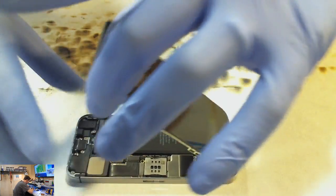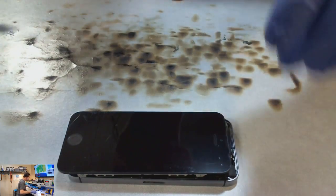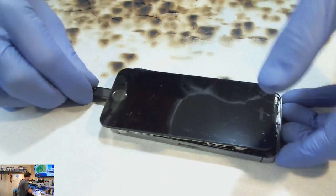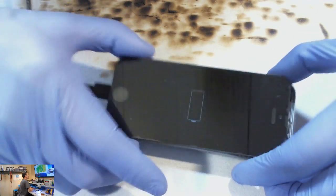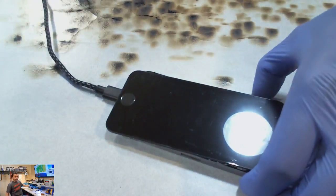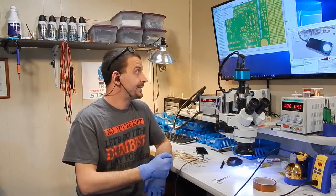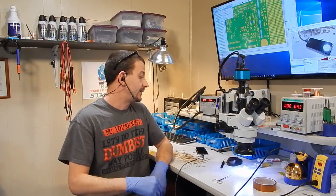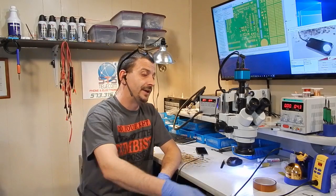I left out a critical check here - I should have checked to make sure my backlight circuit was not shorted to ground, but I forgot. So we're just going to go with it. Plug in our charger. We have battery icon, which means that we have working backlight. This is a really, really simple repair. I didn't have to put that filter there - I could have just ran a wire. The next thing is to take the board back out, ultrasonic clean the flux, apply a coating to my wire so it's held down firm, and then put the shield back on.